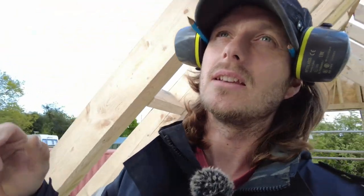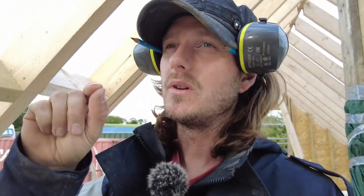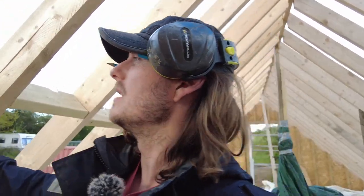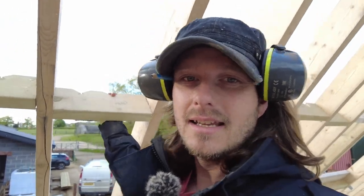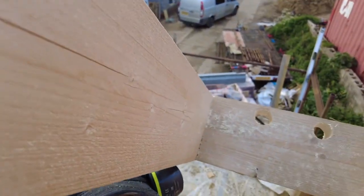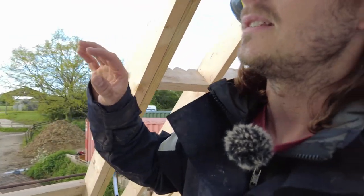That's the job. You might remember I said before that the structural engineer's calculations in terms of deflection on the roof failed on one of the measurements, I think it was very, very high wind or something, and that's the reason why I was putting in the dwarf wall, and I was also going to put in collar ties at the top. Then we thought we'll just put noggins in. So it's the same principle as the floor. If you do it mid-span, it's going to stiffen the whole lot up, so we put them in and it's solid. Now the issue with that is it stops the airflow for the 50 mil gap above these, so we've notched out all the way across. We did it with a circular saw, it was easier that way. We tried with a hole saw first, but that was going to take forever, so it stiffened everything up.